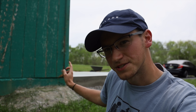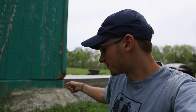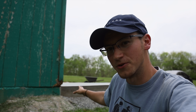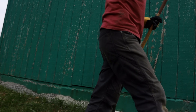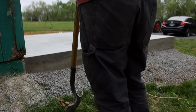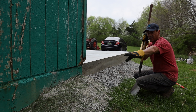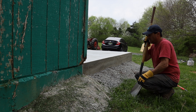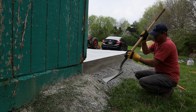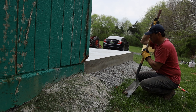I saw a couple people asking about this back corner over here. If you remember, we had a snake crawling up under there, and there was just this big void underneath this corner. So when they were pouring the concrete, we got the extra concrete that was overflowing on the side and shoved it up in there. It happened because of a water issue from the roof that was coming down. It also rotted some of this wood that we're going to need to pull off and replace when we put the siding in. Since our final grade back here will be at about this level, we're going to backfill all of this. Instead of wasting it and having to break it up with a sledgehammer, it was a lot easier to shovel it wet over here. Our concrete looks awesome, and I think it's going to be a good foundation for the additions.